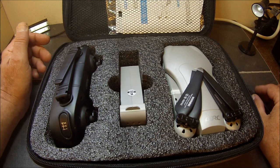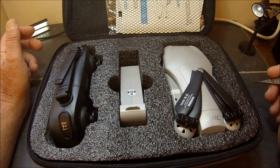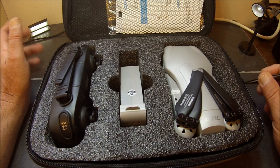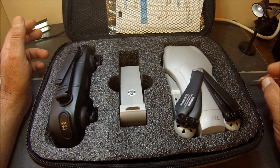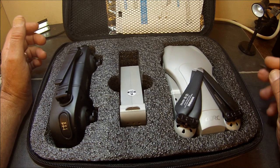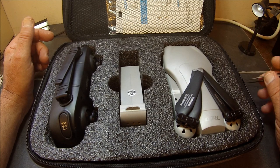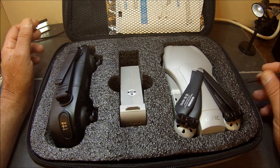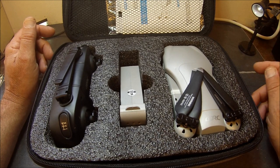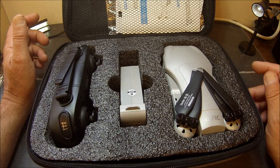It's a brush drone and the product specifications say it's foldable and easy to carry, it's got GPS positioning, security and anti-lost, a 4K camera with dual camera and free switching, and 300 meters long-distance HD Wi-Fi video transmission. It's powered by a 7.4V 1800mAh LiPo battery — that's a two-cell — which should give approximately 25 minutes flight time. In reality I'd say you're probably looking at 20, especially with brush motors which won't be as good as brushless for long journeys.